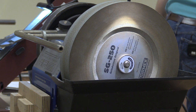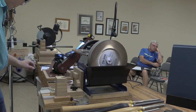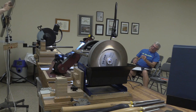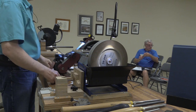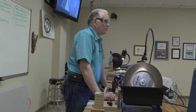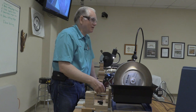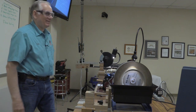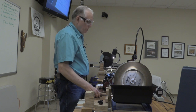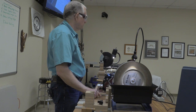Question: I use the Wolverine for everything with CBN wheels from Ken Rizzo — am I missing something by not having these other systems? Does it get your tool sharp and are you happy with what it does? That's all you need then — I'm a tool junkie. The main benefit I can see for the belt setup is sharpening skews with a flat bevel. I really enjoy using a skew now where I didn't before when I was producing a convex bevel.